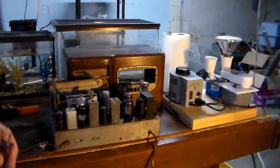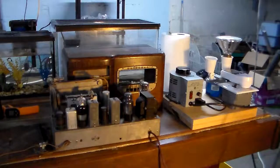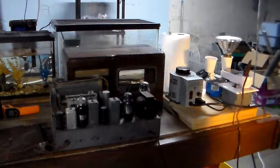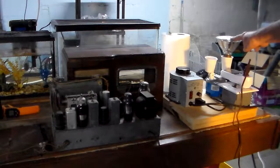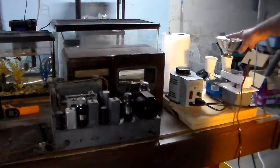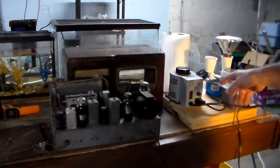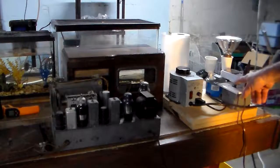And you'll be able to see the great testing center here. Let me get over on the other side, trying to do this without kicking the camera. So again, it's the Variac in series with a light bulb that'll act as kind of a limit on the circuit, so that if it's shorted out, the light bulb will get really bright. And if it's not shorted out, then it'll start to come up. But anyhow, this is to bypass it if I decide to. I don't need to bypass it right now.